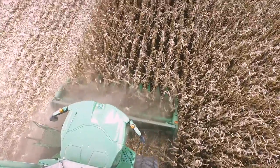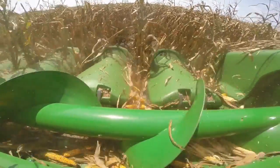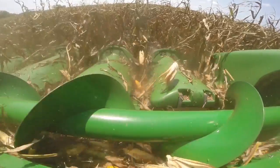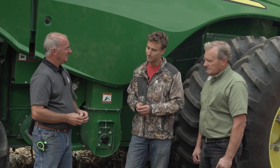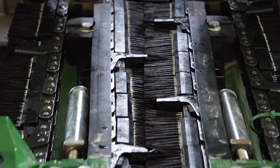The whole process of a combine is truly that you've combined a lot of processes we used to do individually — that's why it's called a combine. You almost have to start at the head. Each pass through the field, we're looking that we're not overrunning the corn, but our head speed is high enough that the feed rate is smooth and even into the combine without running any faster than necessary. We don't want ears bouncing out the front; we want to minimize shelling. Then the deck plate spacing, which varies depending on stalk size and yield. With the yield saver we've been running this last year, we can run a little wider deck spacing and still get all the kernels into the combine.